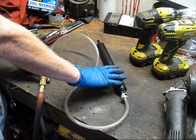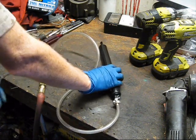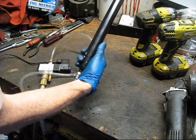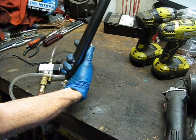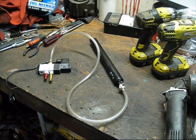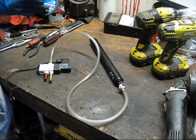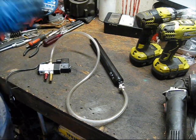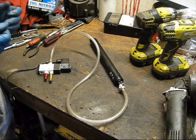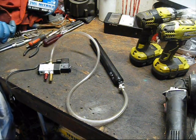I do have to hold this cylinder — I'm only running about 50 psi, but it doesn't take a whole lot of air pressure to actuate these things, so it does have some kick to it. And that's it. This is only 50 psi. You can play with the pressures to get your particular setup to act the way you want it to, but it really does not take a lot of pressure unless you're putting quite a bit of load on these things. My other Halloween prop I actually had to regulate the pressure down to about 30 to 40 psi just so it wouldn't try to tear itself apart.